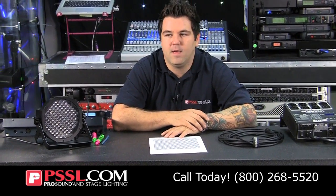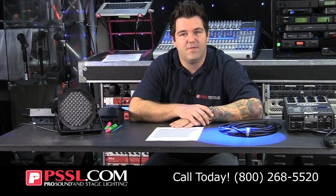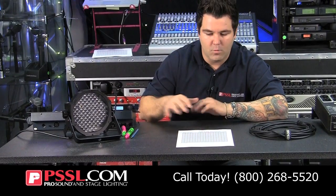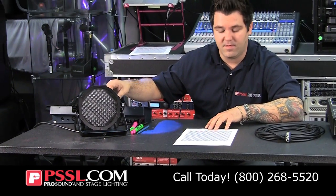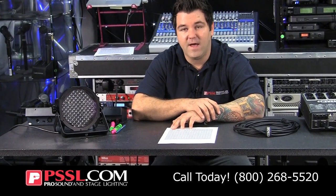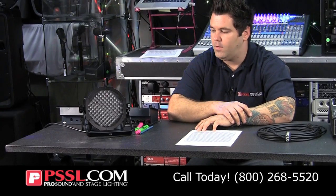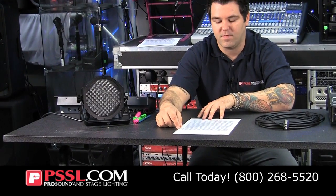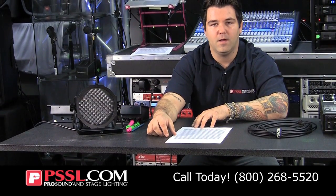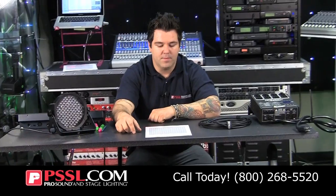PAR cans — people usually don't have just one; they usually buy them in pairs. So let's say you have ten PAR lights and you want all of them to do the same thing at the same time. You've got a couple of options. You can use a DMX controller that lets you speak to ten fixtures at the same time, or you can simply address all ten lights as channel one — or whatever starting address you're using. Using the student analogy: if I have ten lights and I'm calling them all Bobby, every time I want to talk to Bobby, all ten lights do the same thing. So you could see you're not necessarily limited to just 512 channels. You could put a hundred-plus lights at channel one, and that only takes up three channels in your DMX universe.